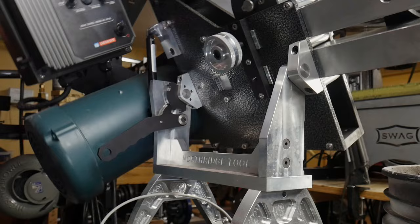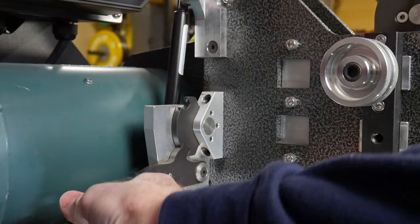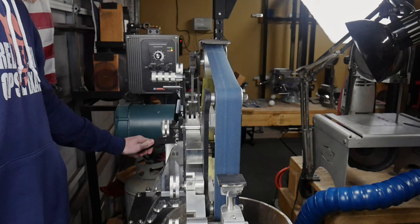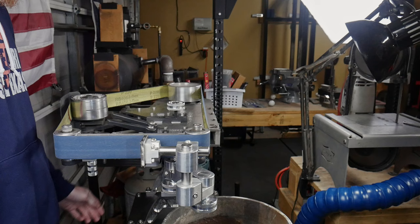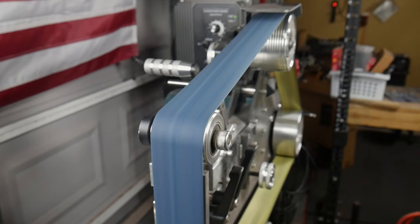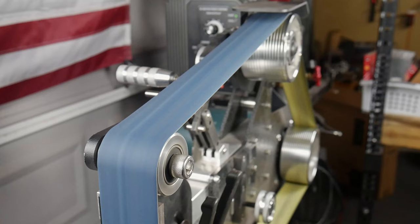Arguably one of the coolest features about this Northridge 2x72 is the ability to easily turn horizontal with this gas shock in the back of the system. When I disengage the catch, the shock will hold the entire weight of the grinder and then I push down on the grinder gently in order to get it to lock in the horizontal position. The same can be said when disengaging — the shock will push it up and then you can push gently to get it to lock in the vertical position. The grinder I purchased is wired up so that I can go in both forward and reverse. The reverse feature can be very nice when working in a garage setting so that I can send all my handle material out of the garage instead of into the garage to make it all dusty.